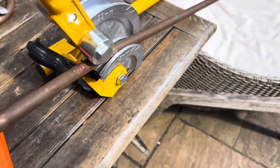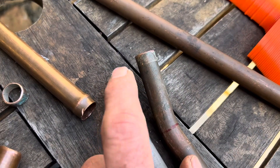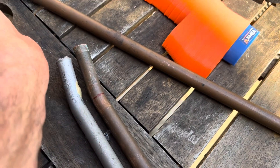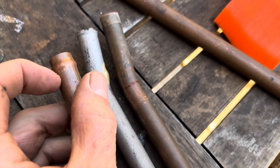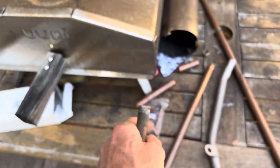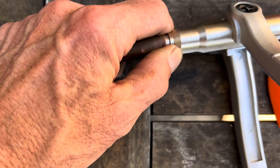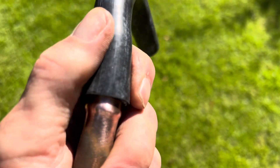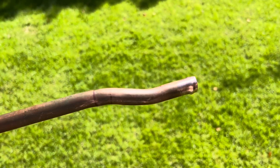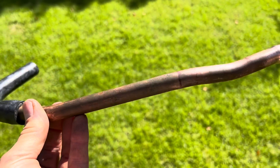Last bend - I've got it marked there, it's pretty much lined up. I kind of have to do it by eye slightly, but that's a really difficult bend because it's bent in three different dimensions with three different angles. I'm pleased at how that has come out. I've just cut this slightly longer than the original pipe because I imagine there used to be end pieces on there. The next thing we're going to do is run a drill inside both ends to get rid of the inside burr, and then put the bead on using our beading tool. The bead went on perfectly with the little tool we made up - it slots over beautifully. So I'm happy with what we've done so far - it just remains to attach the bracket, send this off to the sandblasters and powder coaters, and that will be job done.